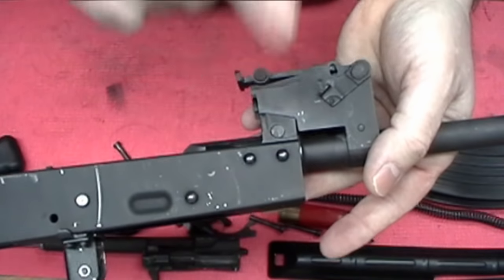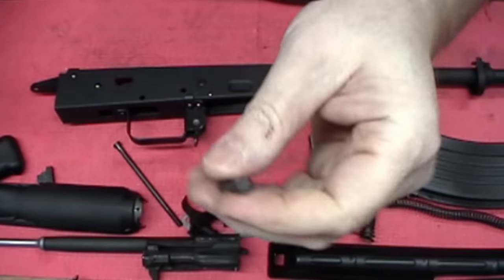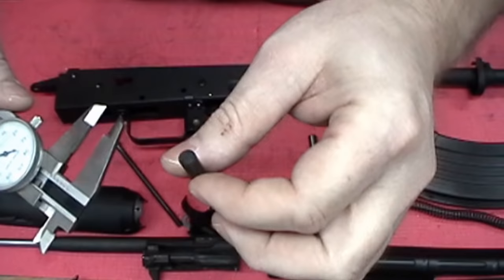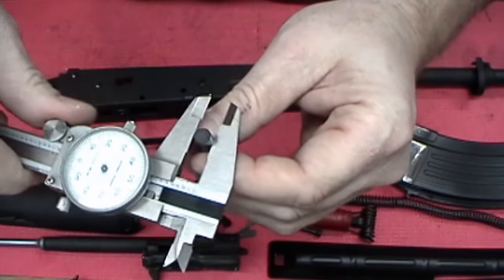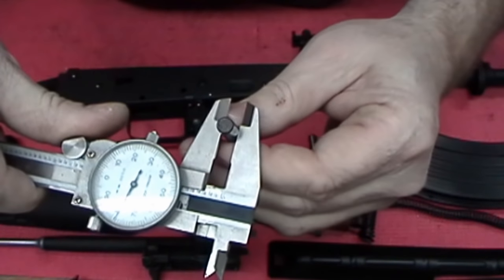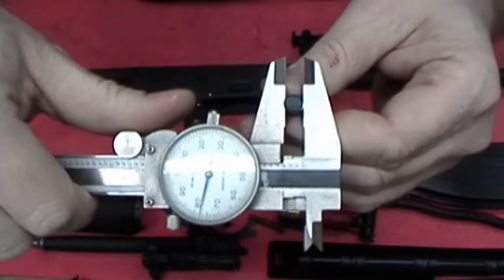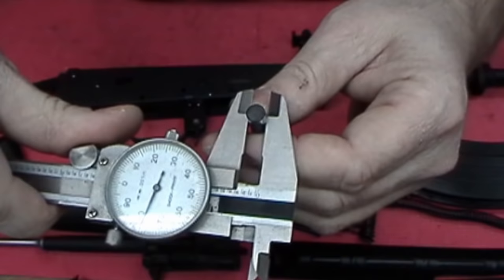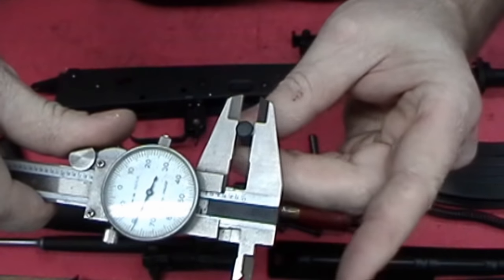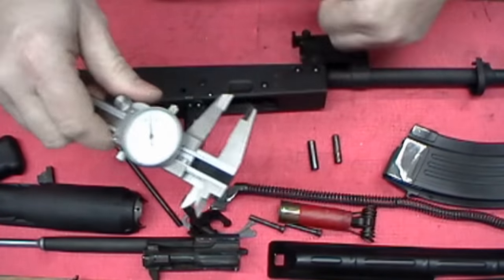This is an original pin — I don't know which gun it came out of, but I've got several of them. Notice I'm spinning it and checking it in slightly different places. I'm getting just moderate pressure right here — you don't want to squeeze too hard because your finger's going to roll on it anyway. I'm showing 278 here, either end, roughly 278. I think the spec is 277, might be 275 — something like that anyway.